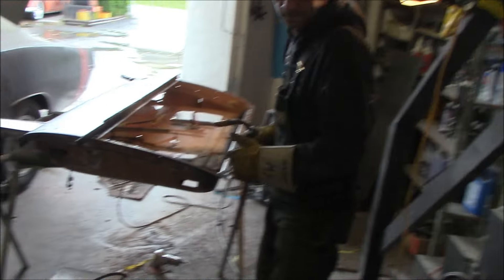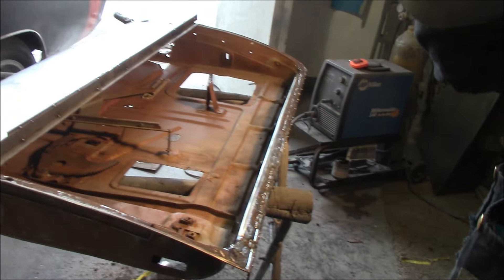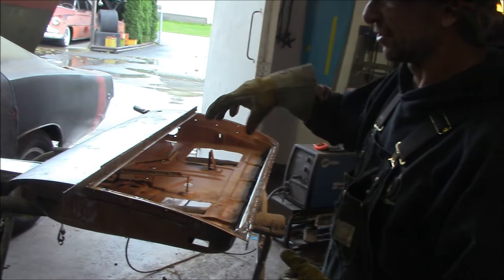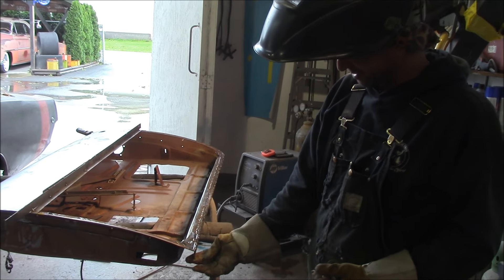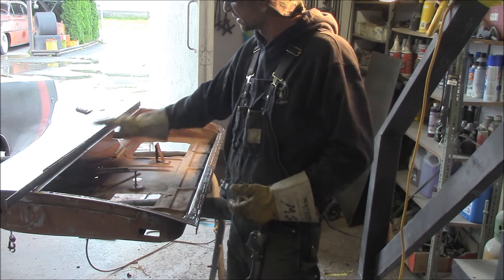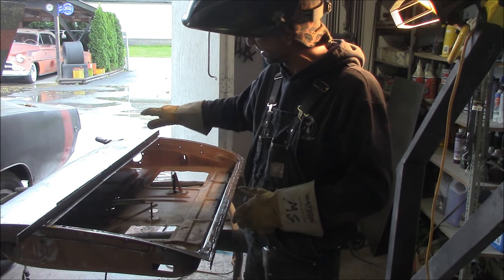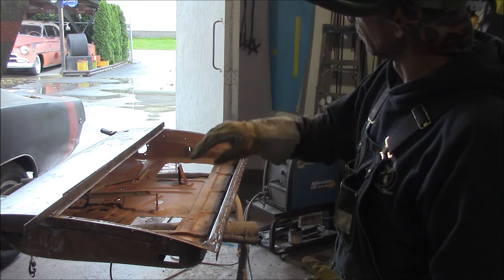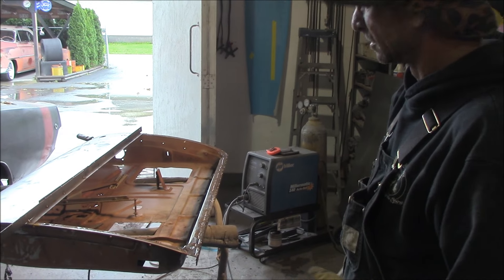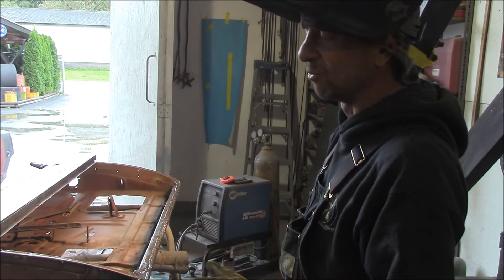Is that not the case, Steve? The whole reason for tacking this piece on is to stop the skin from warping when you weld it up, correct? Steve confirms: yeah, when you weld it up it holds it in place, but you still have to cool it as you go. He also has a piece tacked on to keep it straight — this part is straight, and there's a slight bow he uses two pieces for, so it kind of arcs and holds it in place. As you're welding, it stops it from warping out of shape. There's a tip for the day — brace everything, cool it as you go, and you'll have way less headache.